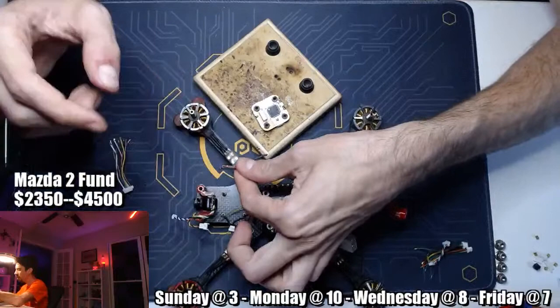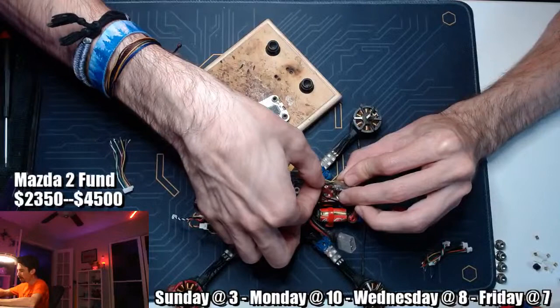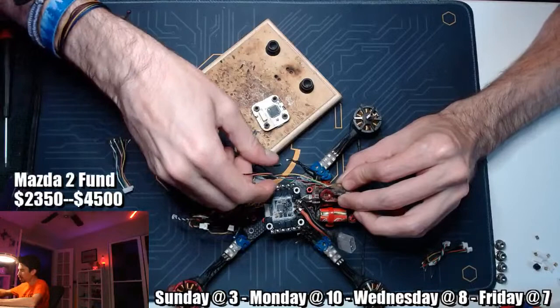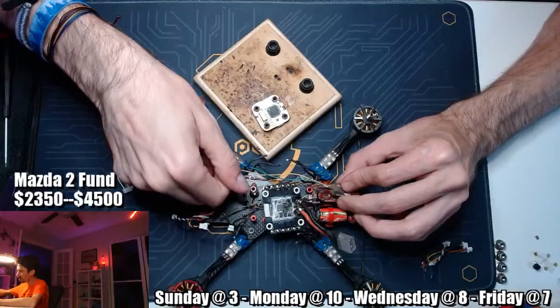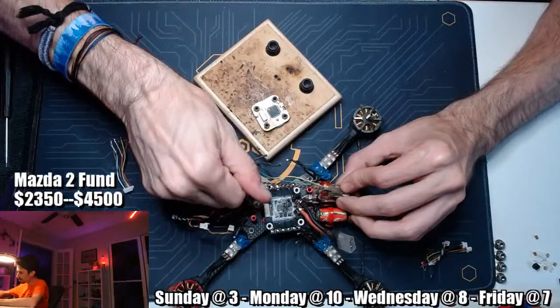So my wire lengths here... Okay, so the 5-volt and ground are longer, but on this, they're going to be farther back. So what I'm going to do is twist up the 5-volt and ground together, separate of the RX and the TX. And what that's going to do is shorten them a little bit. A second ago, this 5-volt and ground was a little bit longer, and now you can see it's pretty much the exact same length as the other two. So let's give it a little bit more twistage here to really shorten it up a little bit extra.